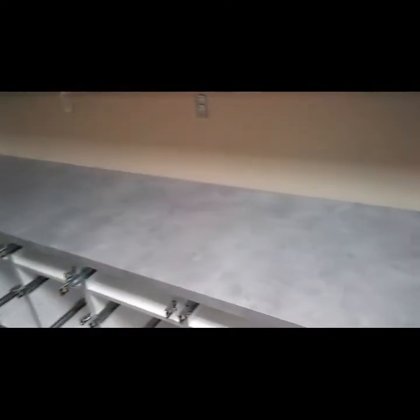Now I should say, if you want to follow the back wall and there are dips in the wall — we're going to put a four-inch splash on in this case, so it'll cover — but you can cut the template to follow the wall or scribe the back part to the wall and that way get it to fit totally tight to the back wall. We're putting a splash on, so we didn't worry about that. We just need that front part to be perfect.